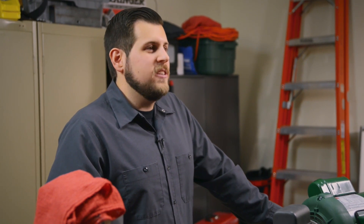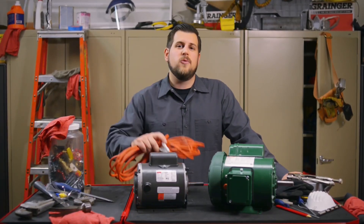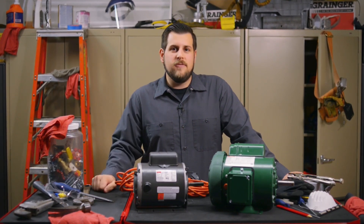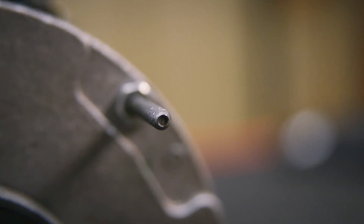For a farm duty motor, proper insulation is important. Avoid using extension cords or long runs of undersized wire. This can cause excessive voltage loss, especially during startup. A 10% reduction in voltage during startup can result in a 19% reduction in starting performance.